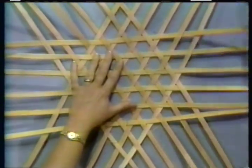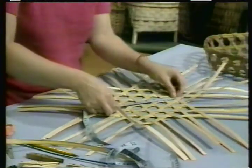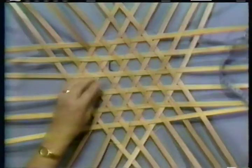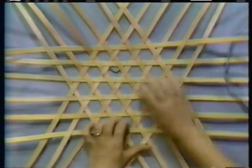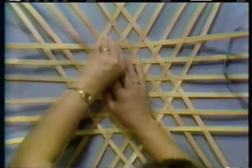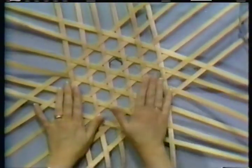This would be a good time to stop and measure again and make sure that I'm still squared. I'm a little bit off on that one side, so I'm going to come back here and just pull these out a little bit. For some reason I'm working a little bit tight, but that's why we measure to find these things out. Pull it out — it was about an eighth of an inch off. Keep working this pattern, working around until you use up all of your 24 pieces.